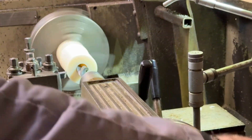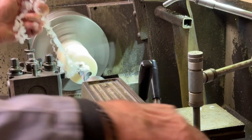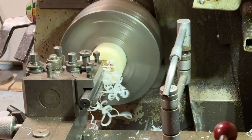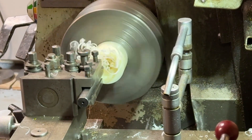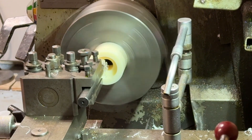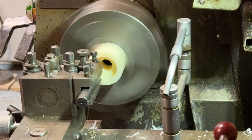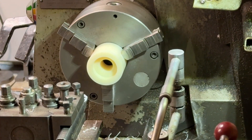This is ready for parting off, and once that's done we can put the single blocks at approximately 50mm diameter and 50mm long. I'll turn them down to the length they need to be, and then as you can see here, I'm drilling the cavity to take the bearing. The bearing is 43mm diameter outside and about 17mm in depth. Once this is done, the block just needs to be cleaned up generally, and I'll put a little radius on the corner so there are no sharp edges on the roller.